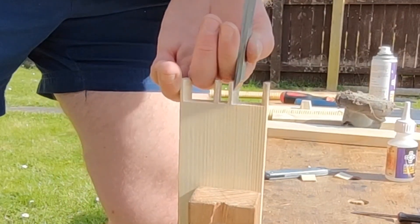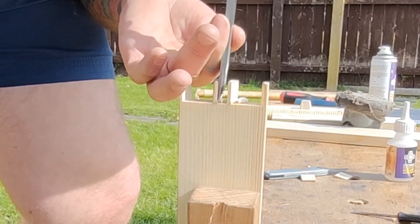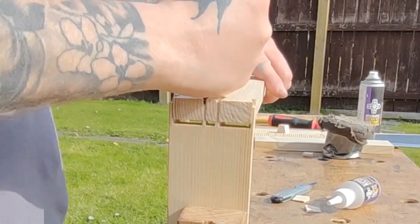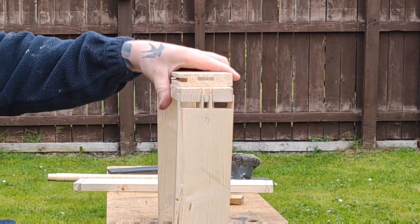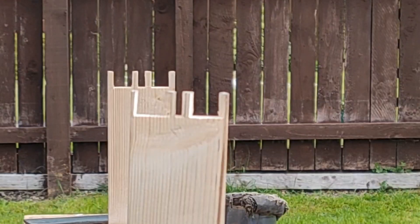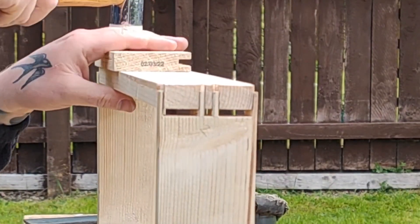On the first joint it was too tight — I didn't get it straight off the saw, which is what I aim for — so I did have to remove a little material from the pins. That said, I did get three of the four corners straight off the saw, which is always good. That's what I always try to accomplish with any dovetail — it saves a lot of time and effort.